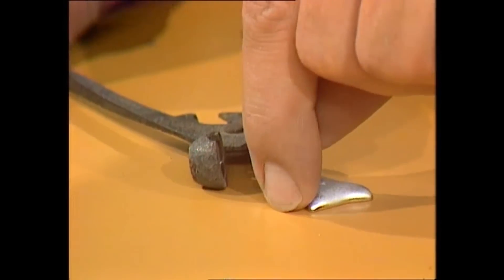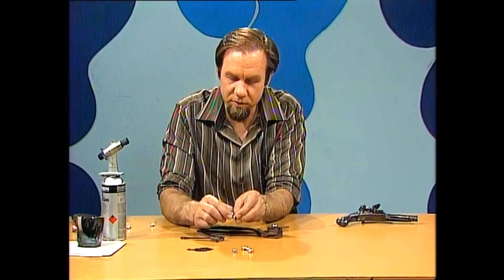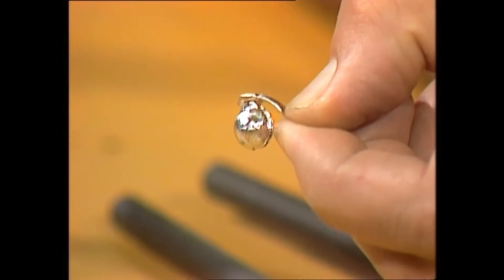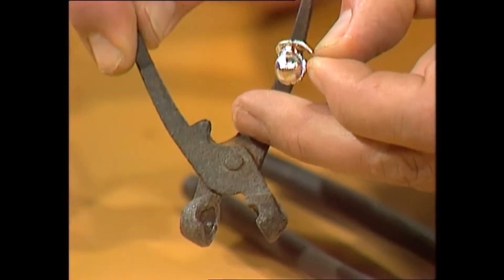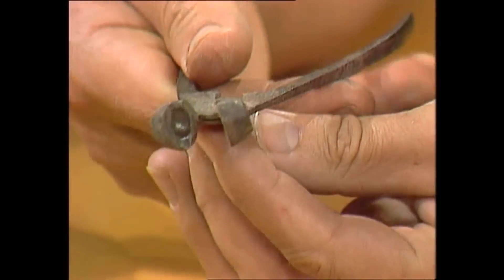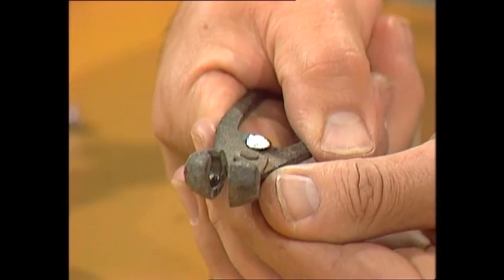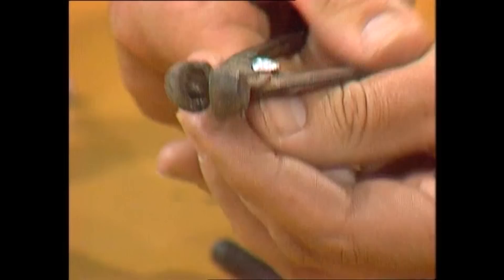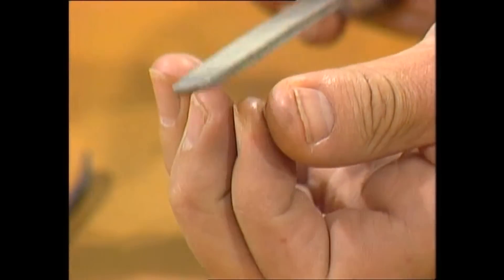That's cool now, so I can prise that out and take off the bits of lead that were no good at all. The trouble is, it was left with that strange bit of apparatus there — it wouldn't have fitted down a gun barrel. So what they had to do was take this part of the bullet mould, which is like a pair of scissors, and use it to guillotine that neck off the bullet. The neck was put into the scissor-like part, the tongs were squeezed shut, and it scissored off that extra bit of lead, which was then melted down and used for the next bullet. A laborious process, but effective — and that was the bullet, which just needed a bit of trimming with a file or something similar.